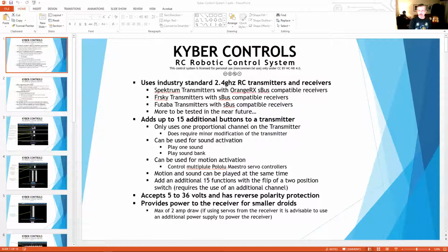And this is something simple I used for the 39.1 Droid. You can see there's a couple of things that we've added in that I add in for safety. A lot of this comes from the stuff we do for the industry, which is having the ability to kill the Droid's drive system completely from the transmitter. So we use Pico switches and battle switches from Dimensional Engineering, and I'll show that a little bit later. And we use solid state relays now instead of the automotive relays for transferring power to the drive systems.